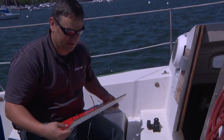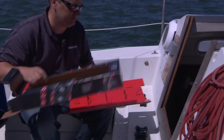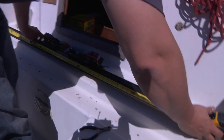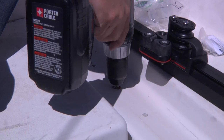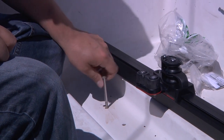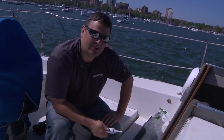Now that we have the track and end controls out, we're ready to measure the track and possibly cut it if need be. Right now I'm just filling in the holes we do not need — we don't need to use every hole with the high beam track because the high beam track, with its internal webbing and height, is strong enough that you don't need a hole every four hundred millimeters.